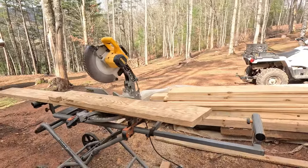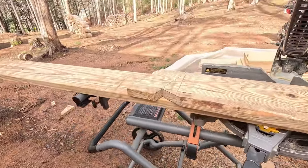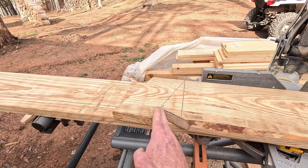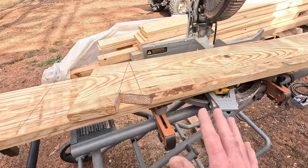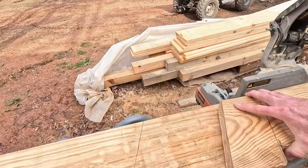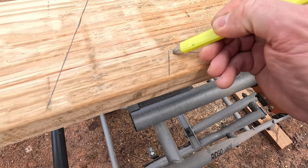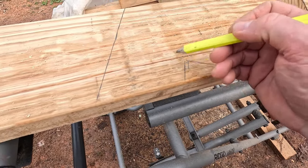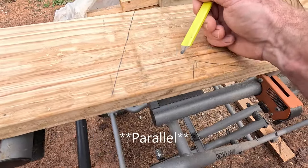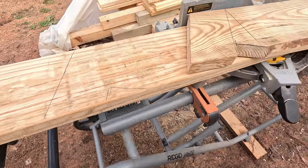So let me just show you here what I've got going on. I do have a pattern — a hard-fought pattern for sure. As I drew it up and cut the seat cut and made some more measurements: when I cut this backside of this seat cut, I actually take off another quarter of an inch. So on this seat cut, the way the pattern has it, I'll end up cutting right there. I'll put my square on this cut here — this angle and this angle are perpendicular. So I put my square on here and that's how I get this angle. The pattern's not perfect, but it does what I need it to do.